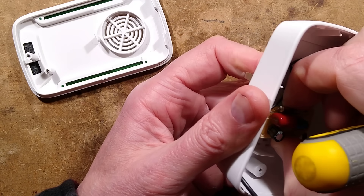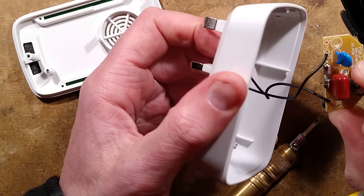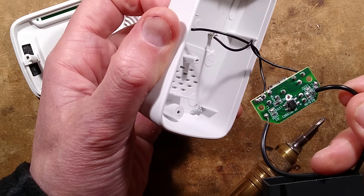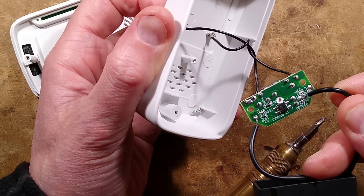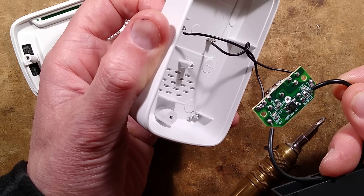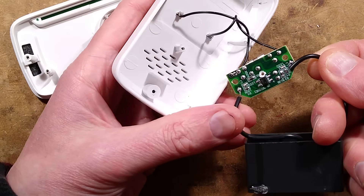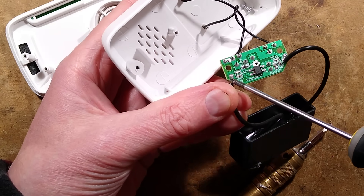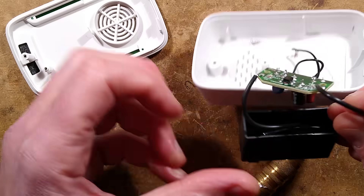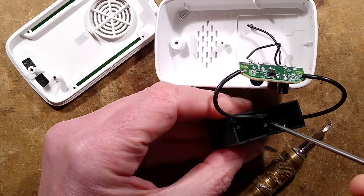So if you want to see the circuit board — does it have a discharge resistor? A bit late to ask that now I've actually whipped it off. I'm not sure if it does — oh yes, it does, I think. That's the same circuit as before, which means that the capacitor is tacked onto a lead that isn't connected. And they've not used much resin — just basically enough to hold the wires in.